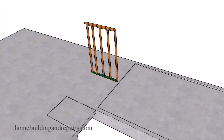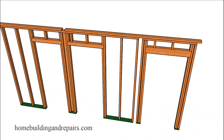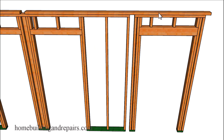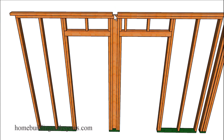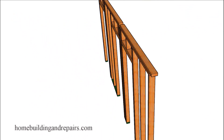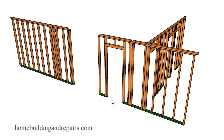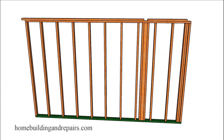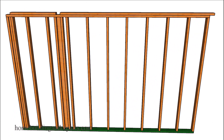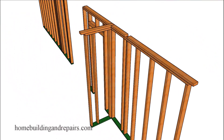Now that we've taken care of the outside, let's look at the inside. We have our laundry area, kitchen pantry, and the front door going out to the porch. We have a wall going through with the top plate connecting the two walls together, a door going into the pantry with our channel and ear, and flat backing for the wall separating the pantry from the washer and dryer room. There's also the entry closet door and the opening going into the bedrooms and bathroom. All door sizes are on the floor plan — I'll be putting together a playlist for this video series, and feel free to leave any questions or suggestions in the comments.